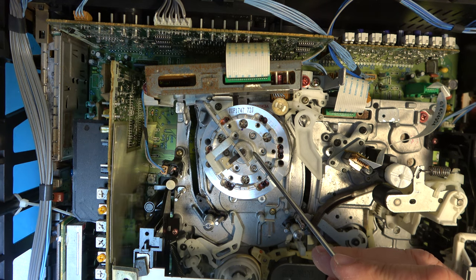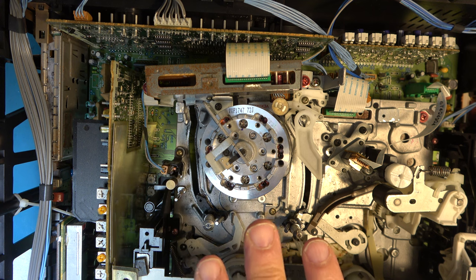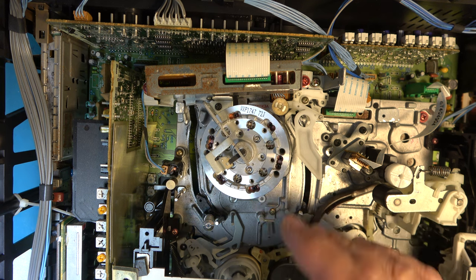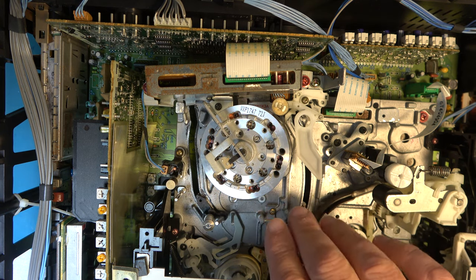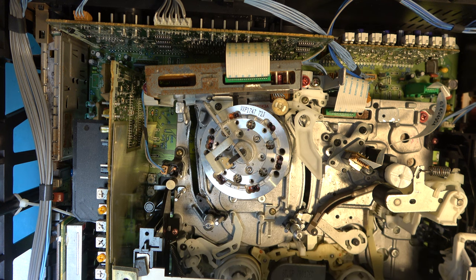If that isn't making good contact, you can get white flashes that look a little bit like dropouts, but keep happening. And if you hit pause, you'll see them working their way through the screen. And that's because there's a static build-up with the spinning head. It doesn't have anywhere to earth itself. And so it discharges... probably generates a small spark somewhere. So that's why this is extremely important on pretty much all video recorders.